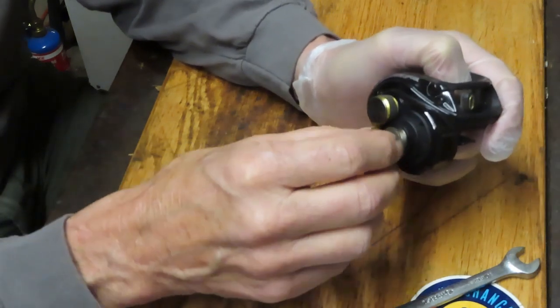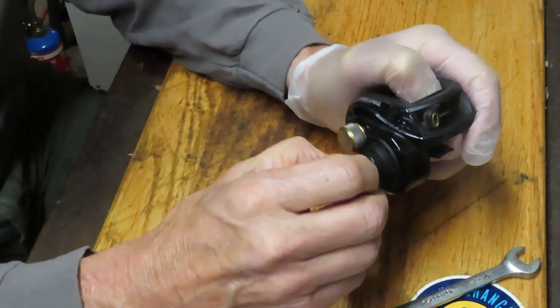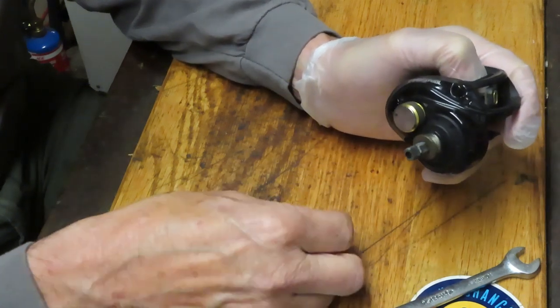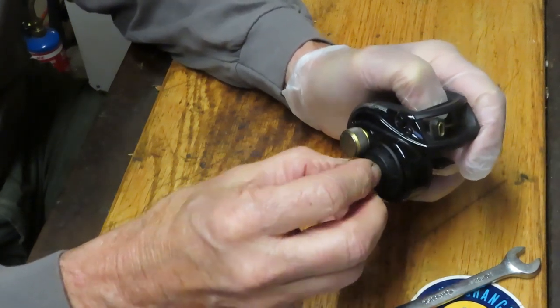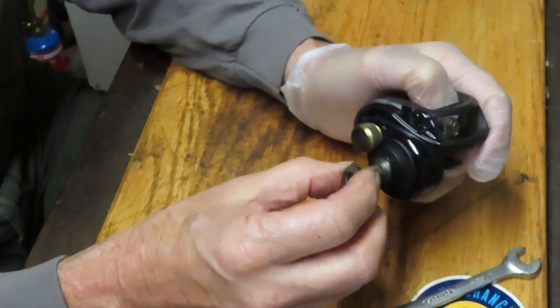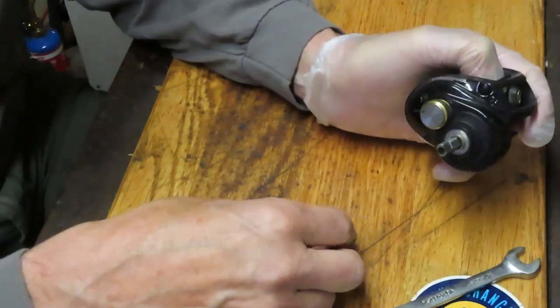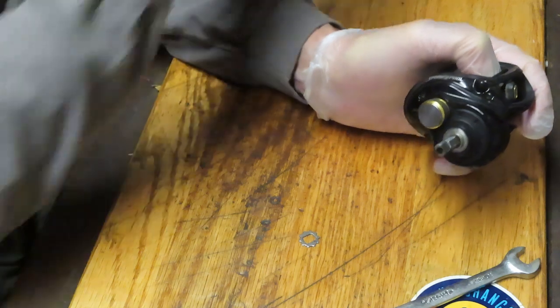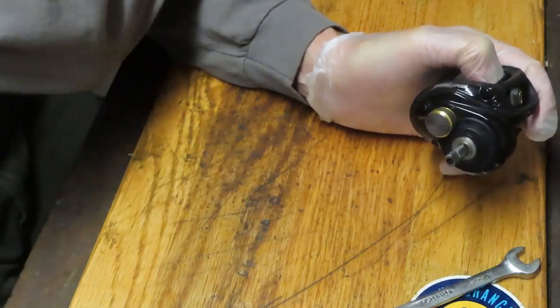There's a click ratchet that goes next. There are 2 tension washers behind that are smaller. They are not flat washers, they are concave or convex. Then there are 2 larger ones, same pattern. They've got a belly on them, and those typically go belly to belly, if you will. So I'm going to just take those and put those in my parts tray.